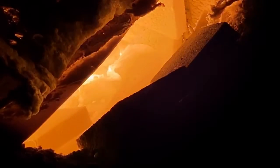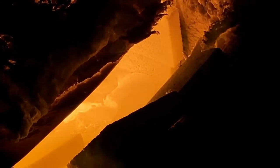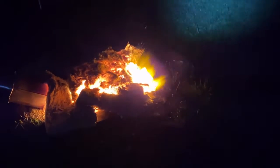Right around this point the furnace walls fell in and began to deflect the flame away from that second rotor. You can see there's a little bit of boiling going on right on that edge — it's slowly melting that metal. But now that that block is in the way, you can see some liquid metal to the bottom left. We're melting brick and everything at this point, and the brick has fallen over pushing the flame away from the rotor, so I end up stopping short because the flame is no longer impinging. My bricks melted and fell directly in the path of the flame, so it's no longer hitting the metal very well.